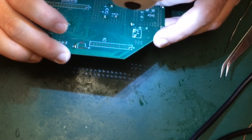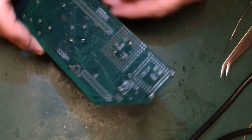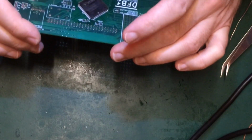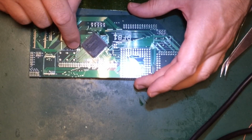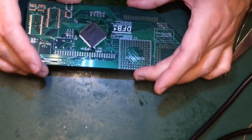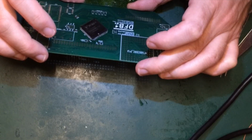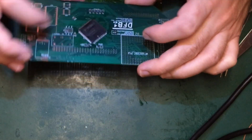Right, it's also got the R1 there. I'm not going to fit R1 this time. Right, I think that's all the hundreds. Is there any 100 on the top? We've got a resistor. That's for the clock lines. I don't think there's any capacitors at all on the top. Two more resistors there. R18 to be removed if using X2, yep, so I will populate all of those.